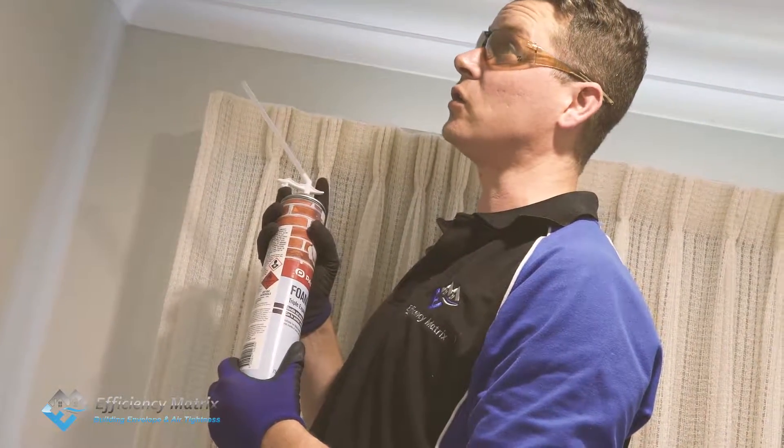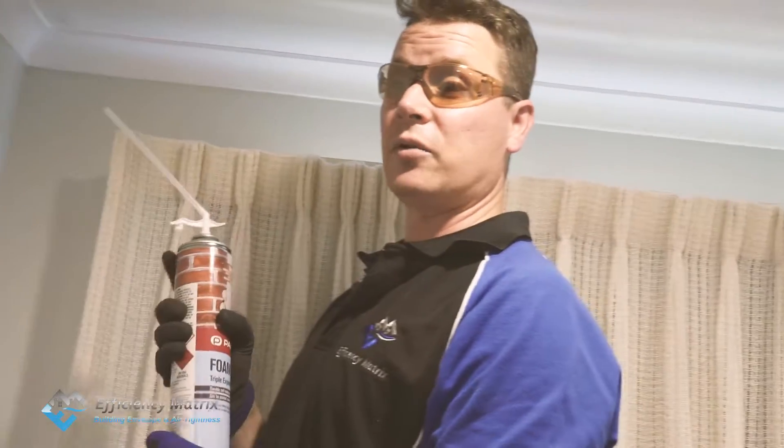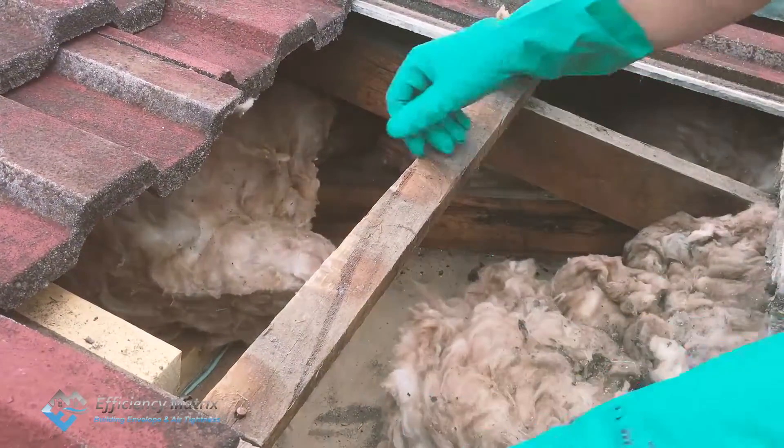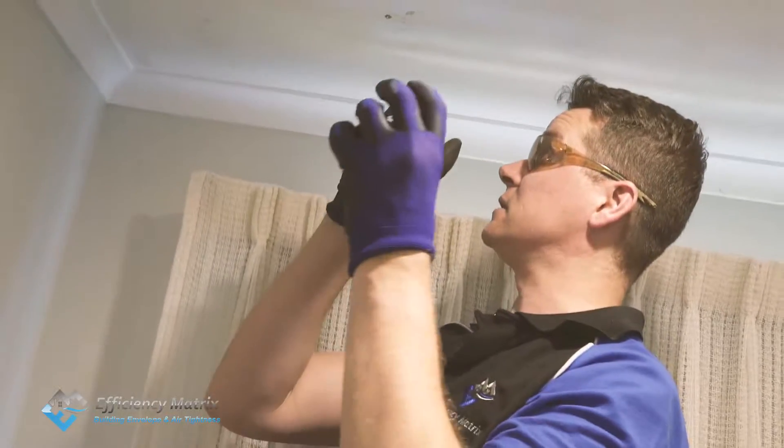In this area we've used a couple of cans. In some areas you're going to need to, because the expander foam needs to be sort of local to where the issue is. In this particular area, because of the ridge, we were unable to actually fix the insulation manually, so we've had to introduce foam-a-fill. In most cases you'll be able to pull back tiles and fix up the insulation manually, which is very easy to do.